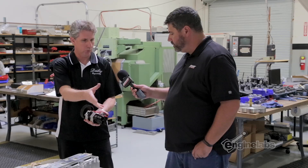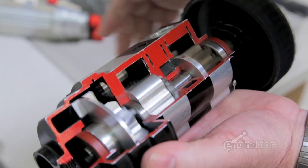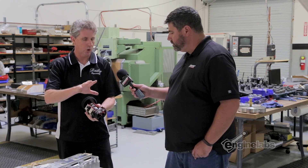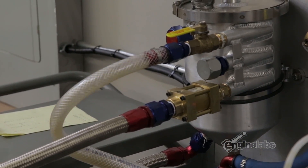Foamy oil goes in, because that's what comes out of a motor. The air separator is a hydrodynamic centrifugal device. The centrifugal forces of the impeller force the foam outwards. It gets to the outer barrier, where there's already previous de-aerated oil rotating around in a circle. What that does is create a hydrodynamic wedge in that film.